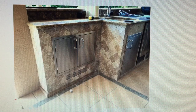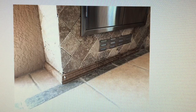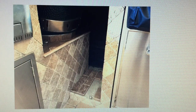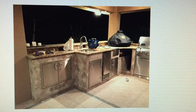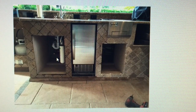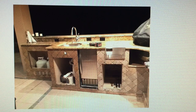I put this stone base around it, which gave it a little extra detail. It's also a very close color to the granite, so it kind of framed it out. It's a real pain to cut — each one of these is cut at a 45. Here's this area where I keep the grill parts. Here's some corner trim, which is also travertine, shaped on a sander to cover this seam. Here it is prior to staining. Here all the base is installed, doors are just dry fit. And here's the area that's been sealed versus the area that has not been sealed, so you get an idea of the difference.